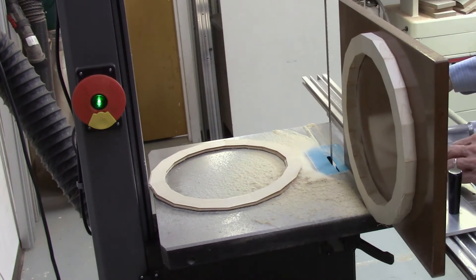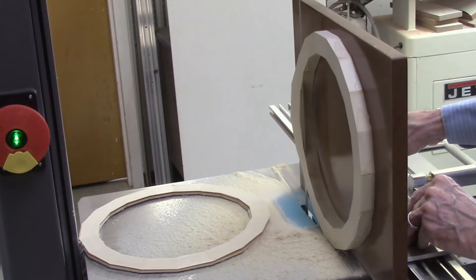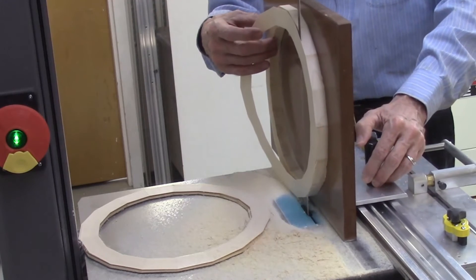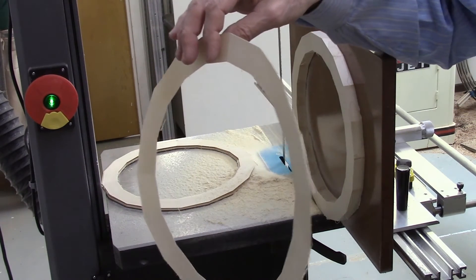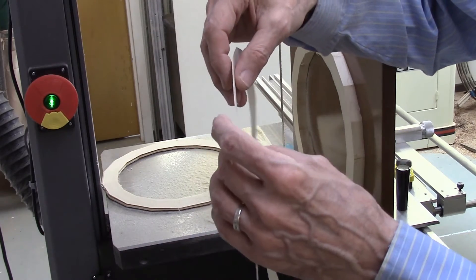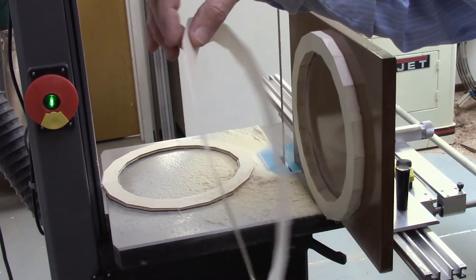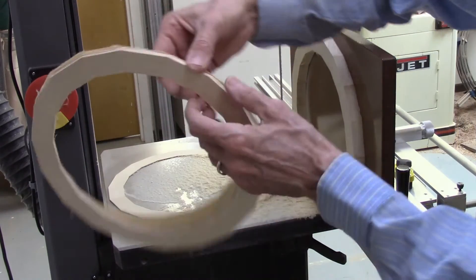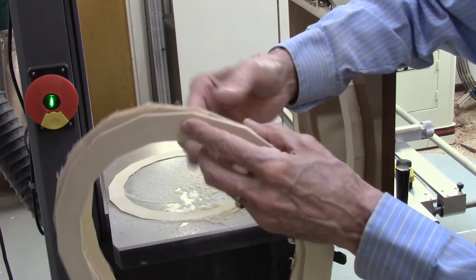And finally, as we did before, we'll do another 10-thousandths inch thick slice. There's a 12-inch diameter segmented disc — a 10-thousandths inch thick slice using the AccuSlice system. Extremely fragile; I think if you breathe on it too hard, it's going to break. It's actually warping now just from the moisture in the air and the heat of the blade. But again, very smooth cuts, very straight, extremely parallel. So from that one board we were able to cut a 100-thousandths, a 50-thousandths, a 25-thousandths, and a 10-thousandths inch thick segmented ring.